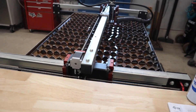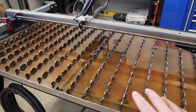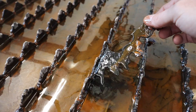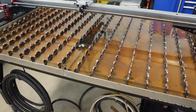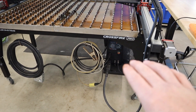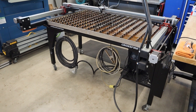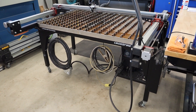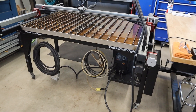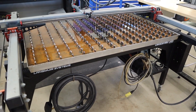That's basically the gist of what this machine requires. It does have this water table that you have to clean periodically because it will get pretty gummed up — you can see some chunks of old steel that have been cut. There are some drain plugs on the bottom. I actually added that little shelf on it because the plasma machine used to sit on the floor. It's a really nice machine and you can make quite a bit of extra money. All the custom steel sign stuff is really in right now — everybody wants it and I have trouble keeping up with orders. So it's worth looking into.